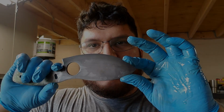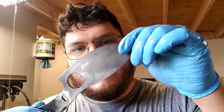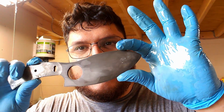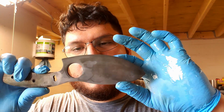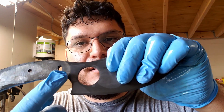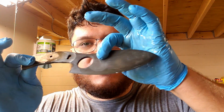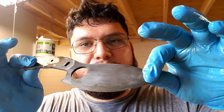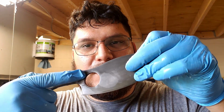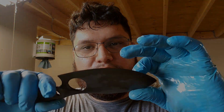This, I got it out of the edge. It's turned into a light gray, light darkish grayish. Looks pretty cool. I like dropping them in the etching because it looks pretty interesting. I like this little ring that I made right there. You can see it. That little ring is the temper line from where I got only this part really hot, and then I dropped it in and heat treated it, and that's the line that marks where it's harder metal and softer metal. It's pretty cool.